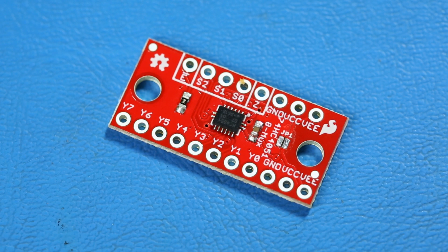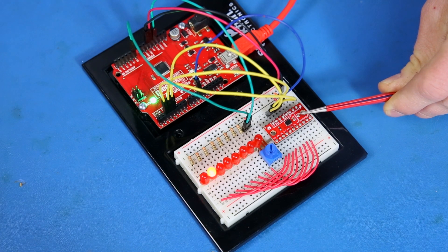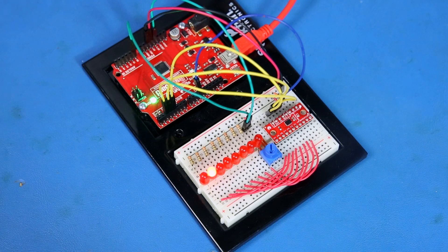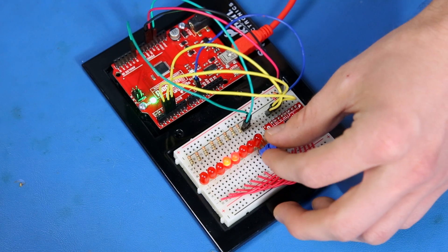In fact, we've done just that. In this demo, we're using four lines to individually control eight LEDs. One pin is acting as the pulse width modulation signal and the other three are acting as the selector. As we adjust the potentiometer, we can control the refresh speed. At a certain point, the light appears as a static pattern to our vision.